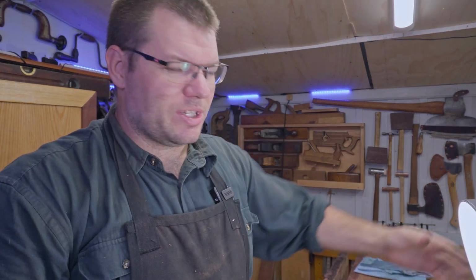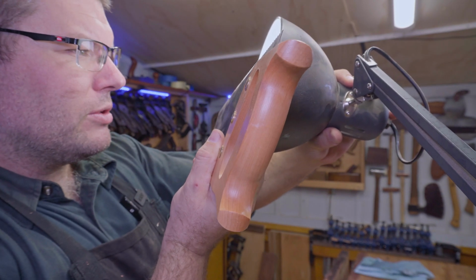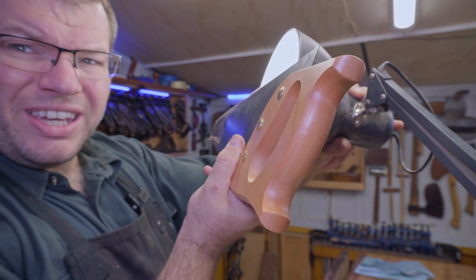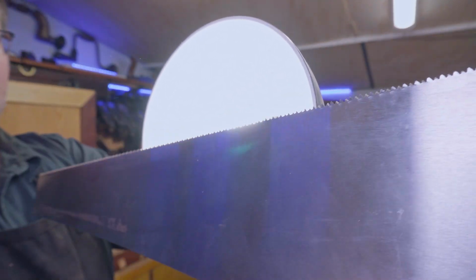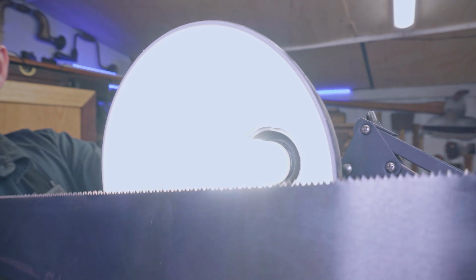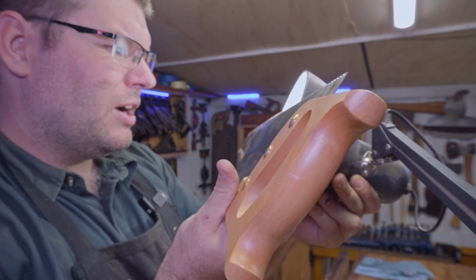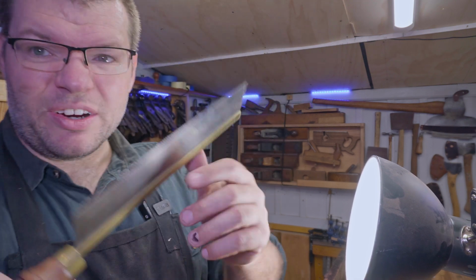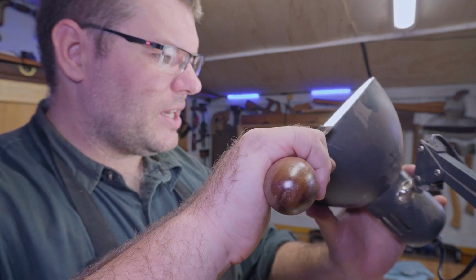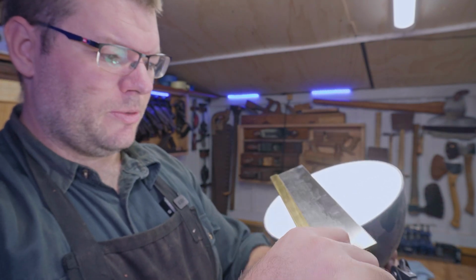Once again, in this process, get that light right up behind it and have a really good look across it, so you're not looking into the actual light. If I show you here, you're not looking into the actual light. So the light's in the center there. You're going to come up like that with it and then view across it. And I find this is the easiest way, especially with very, very fine set saws.